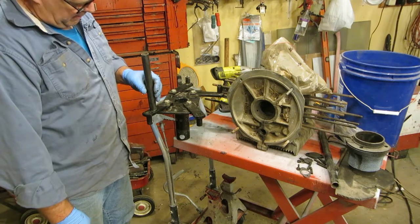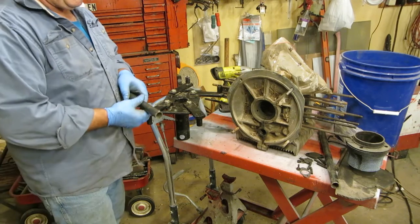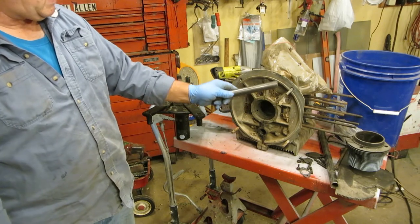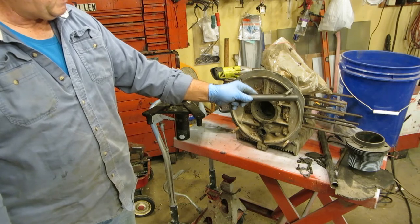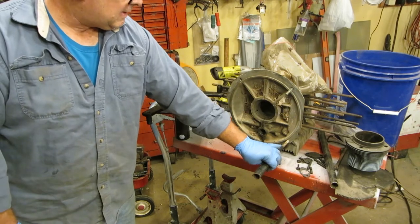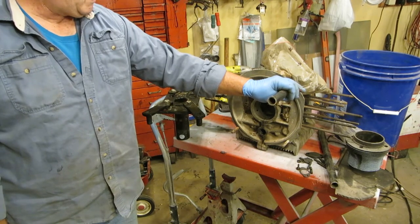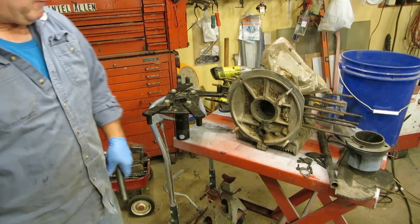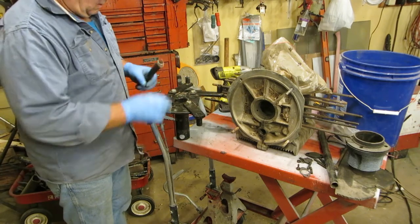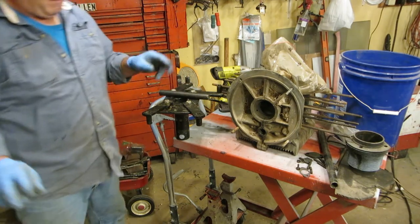And if I weld a piece of pipe on each side, then on the end of those pieces of pipe I can weld a piece of 3/16 or 1/4 inch material that has a slight radius to it on the inside, and a nice couple inches of platform either side. It should get me out of my flywheel. I could even weld it out farther, outbound a little more, and be able to mount it to this, which mounts to the center pivot. So, homemade halfway.